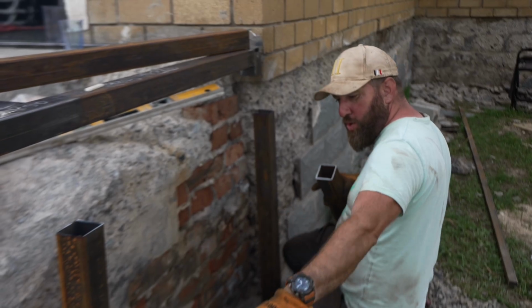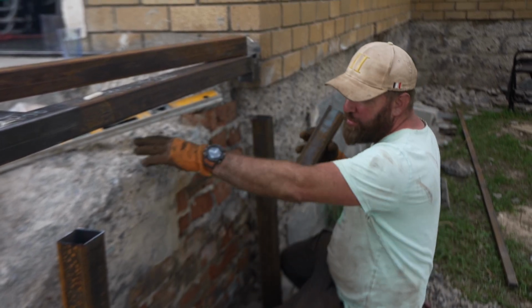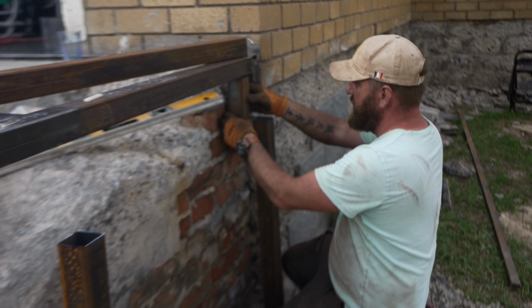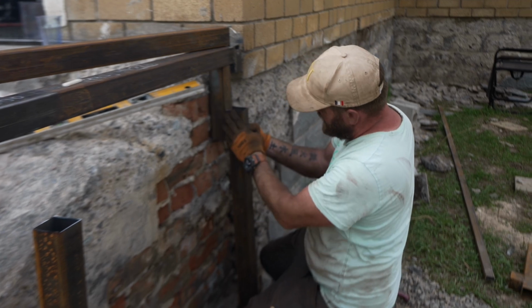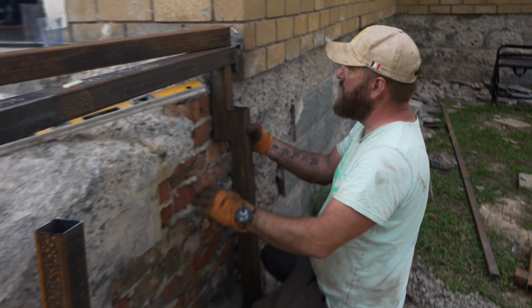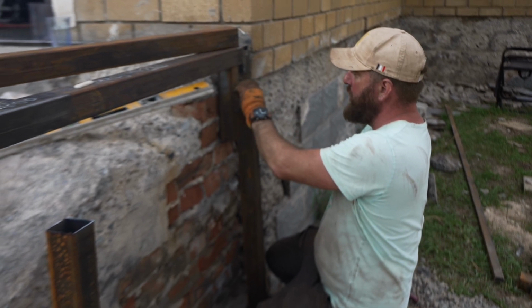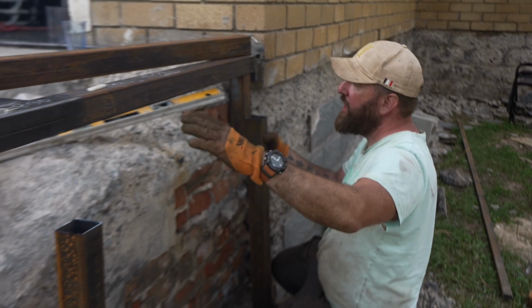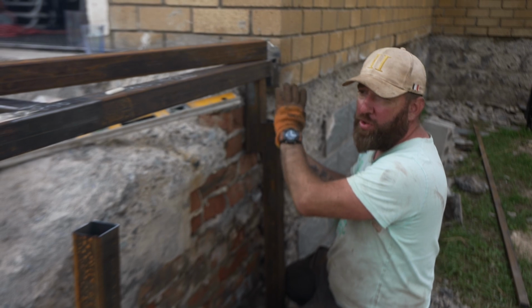Came up with a new baseline here. It's going to have legs like I had in the middle there. I actually got two small pieces. I'm going to attach that, weld that into place. Then that's going to get welded to that, bolted to the ground. Then we can take this one, which is the new ledger board, and have it on top here. Weld it there, there, there, there, and weld it to the next pole. And that's going to give us our 15 centimeters for our step.